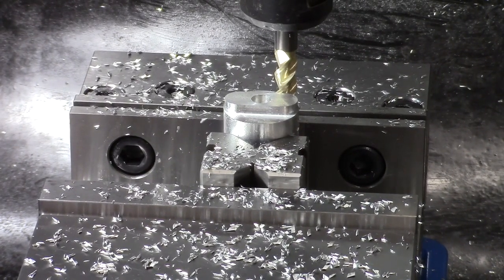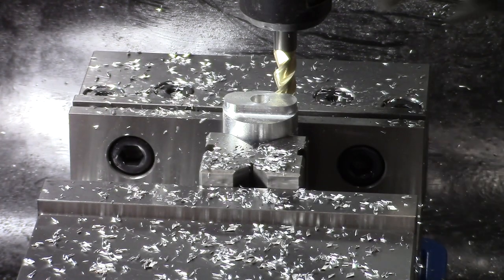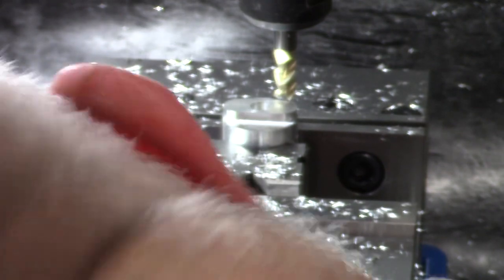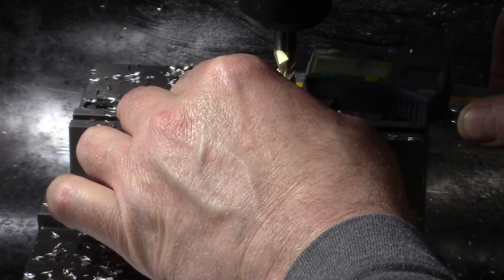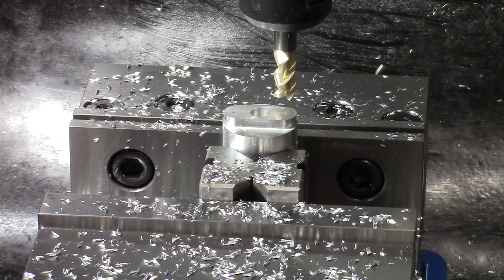All right, I think that's in the shot. Given this is way too big, I've got to figure out where I did the math wrong. But let me drop the table back down. Pardon my head. Ain't a spring-loaded thing. Safe. Okay. So we have roughly 1.196. And we were looking for 835. 1.196 minus 0.835. That's 361 thou.